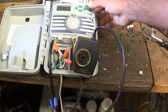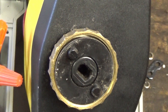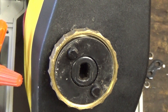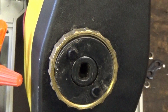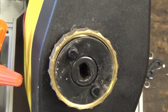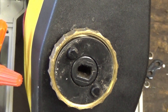Let's fire up a cycle now. We'll get zone one going and zoom in to see what it's doing. It just clicked on — zone one is now opening. The motor is opening the valve right now. And now we're open. The motor just shut off, and now we're in the open position. We're going to advance it to the next station, number two. Zone two is opening, zone one is closing. The motor is closing the ball valve — a nice, smooth, slow operation.